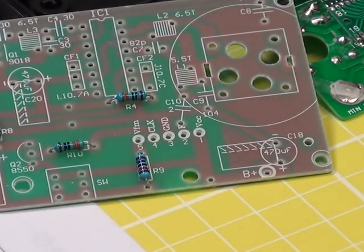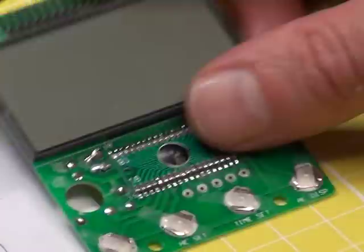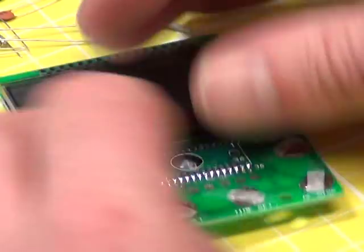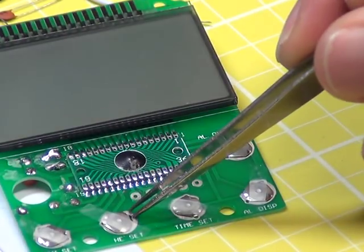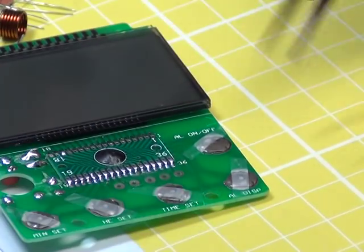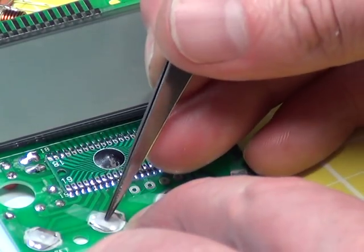If you'd like to move the display board to the left, we can discuss these dome switches. We'll have to fit the five dome switches, and they are done by careful placement, and then they're covered in adhesive tape. We tend to always use the genuine Scotch tape.